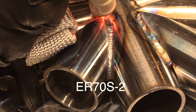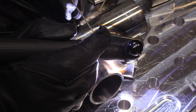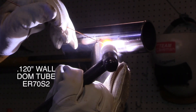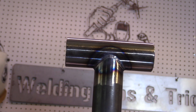Research into welding 4130 chromoly tubing shows that 0.120 wall thickness and below can be welded with ER70S2 without a preheat. Anything over 0.120 wall thickness definitely could use a preheat. It won't hurt to preheat 120 thousandths wall thickness, but it's not necessary. On a joint like this, pulsing the pedal is a common technique used in the motorsports industry. On 120-wall DOM tube, which is just plain steel like 1020 steel, ER70S2 is as good as anything.